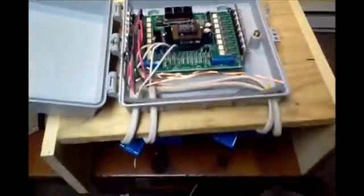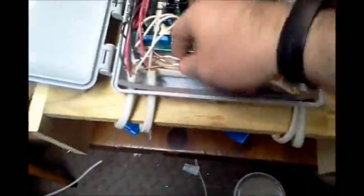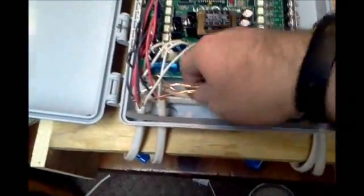Whenever I hook one of these up, the top row will be 1, 2, 3, 4, and the bottom row will be 5, 6, 7, and 8. So that's how it's going to go. Let me flip this over. You can see here are the cords bent underneath. I'm never the neatest wirer to ever do this, but I'll connect all of these and ground these right to the box — all of my ground wires.